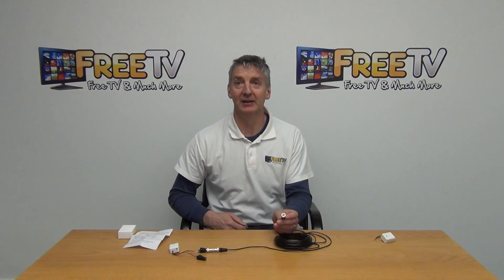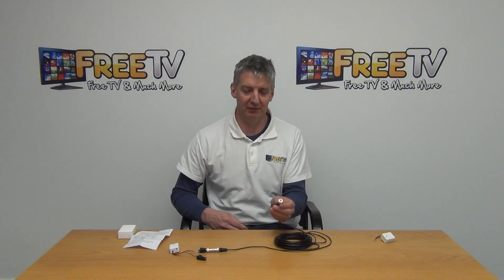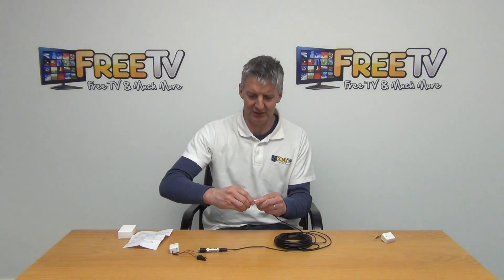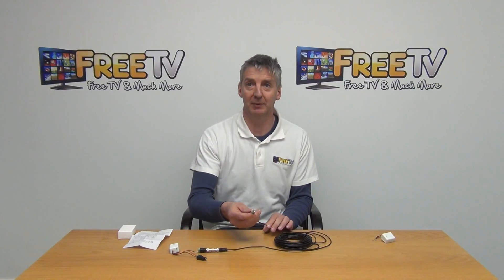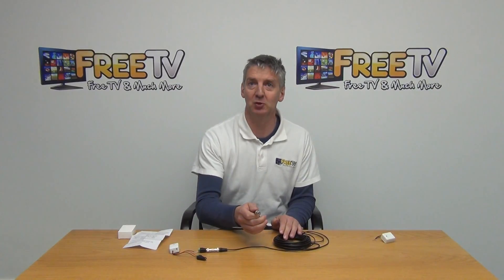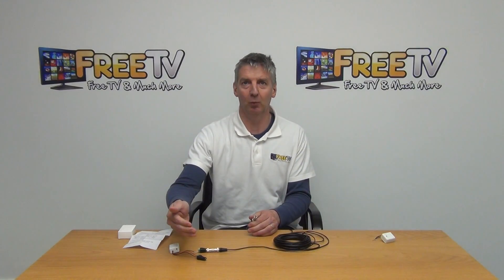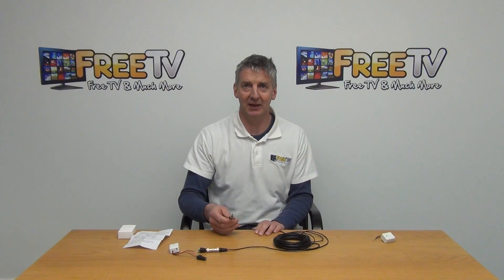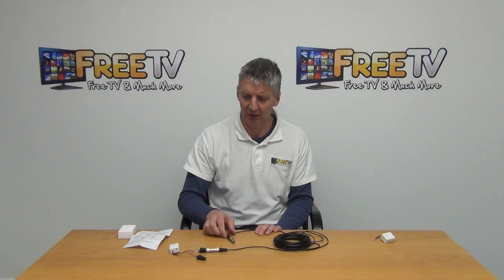On the far end, if the DVR has a BNC-type audio input you can connect it there, but more normally it will be an RCA phono-type connection. You can use a BNC-to-phono adapter and push it directly in. Most DVRs have audio inputs, so we can connect this directly into the DVR alongside the camera feed.